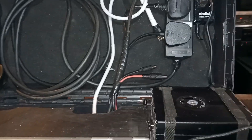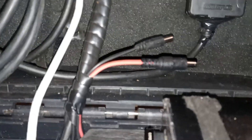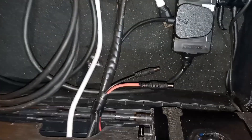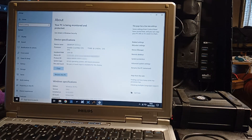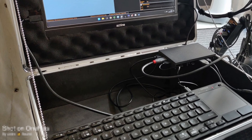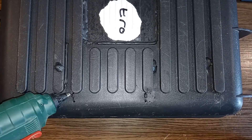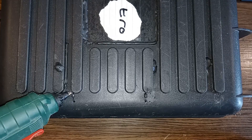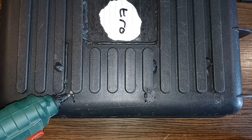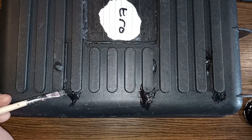I've simply made up an extension cable to run out to the DSLR, and the other extra supply is for the 12-volt fan on the back of my telescope. Pending a more powerful laptop, I now have this case all set up for all my connections. Attaching things to the case I've done by drilling small holes and feeding small cable ties out and back around things, then using hot glue to seal up the holes and smooth off any sharp bits, with a little bit of matte black paint to match the outside of the box.